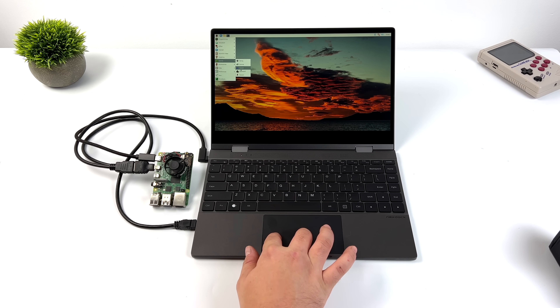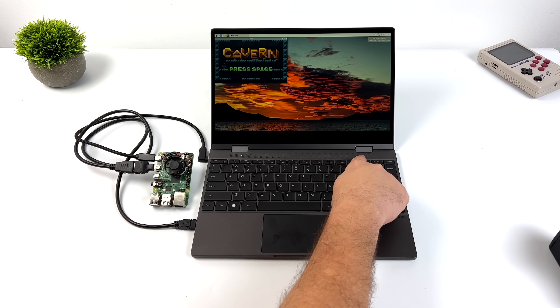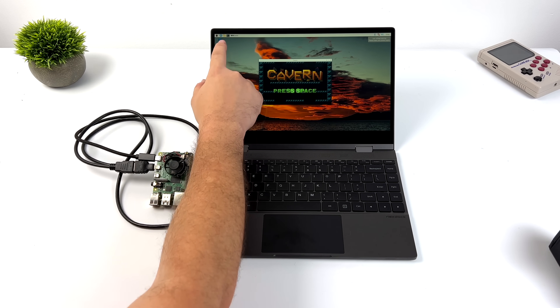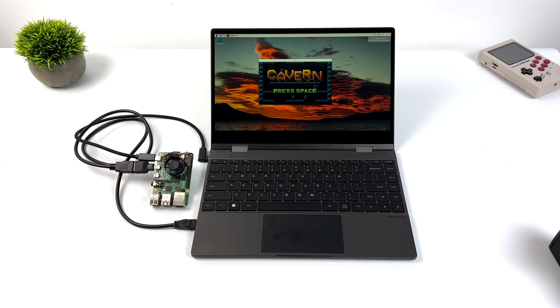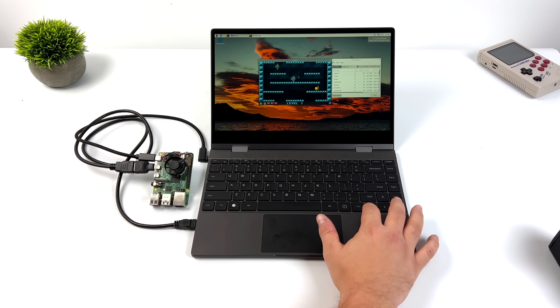Keep in mind, we're now totally battery-powered with the Raspberry Pi 4, so if you want to take this with you, it's pretty easy, but we do have a mess of cables because the Pi doesn't support display over USB Type-C — it would be amazing if it did, as we'd only need one cable. Touch is working with the screen, but everything's a bit small at 1080p with Raspberry Pi OS, so I would probably drop to 720p if I wanted to use this as my main display for the Pi.